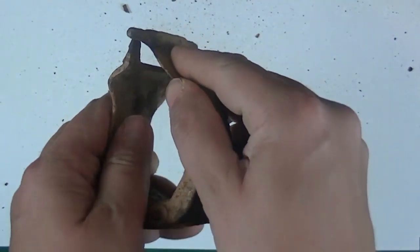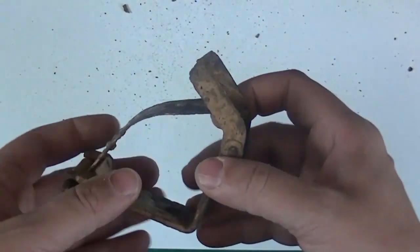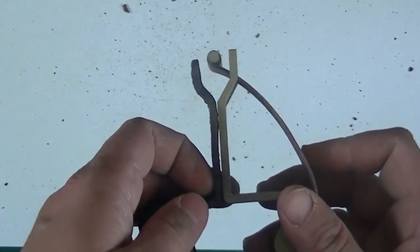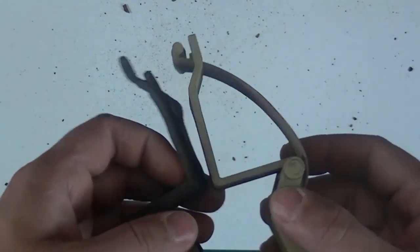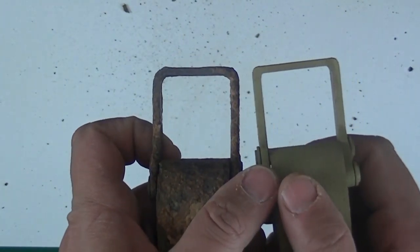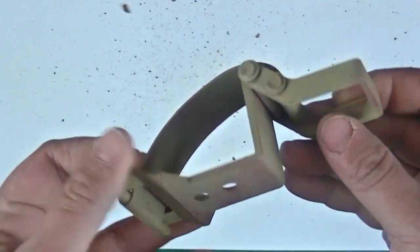The major way they work: this bar slips under here — that's the big difference between Type 1 and Type 2 — and then that band wraps around this way as I showed in the 3D stuff. This is one that I created before I had a lot of these, based on the measurements of this one. It's basically this guy but a little more rigid — the bends have a lot more subtlety in them on the originals, whereas I just went straight with what I had measured with my calipers. This is a 3D printed one — the handle's not quite right, it's too square, and the real ones are a lot more rounded. This was just my first test to see how they would work in plastic prototyping.